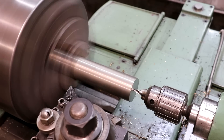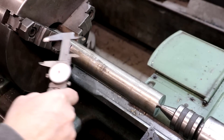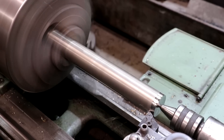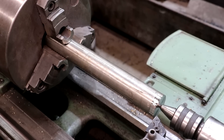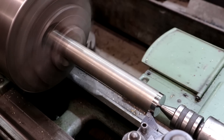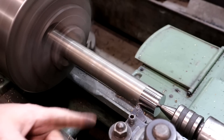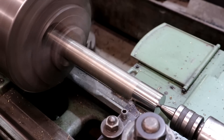All right, that should be plenty deep enough to give us a good center to support that. We're starting out at one and five-eighths, or 1.625 inches outside diameter right now. I'm going to take about 30 thousandths right now just to kind of start, but it's not cutting very good at all. Let me tighten this tailstock up. I changed my cutter and slowed my speed down just a little bit, and that does seem to be cutting a lot better. I think I just needed to change that insert out on the other tool, but this will get us going. Let's let this clean up to where it needs to be.